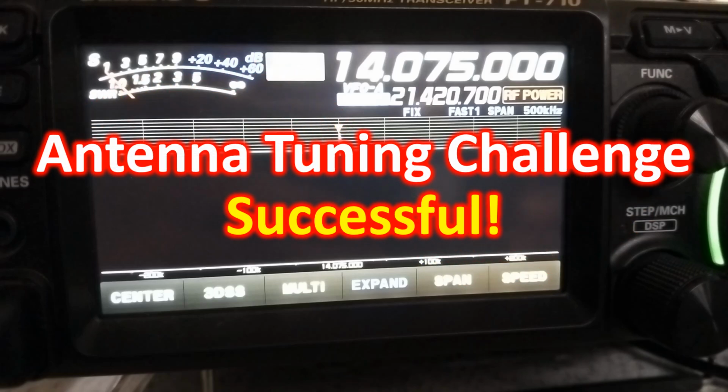It is possible that the antenna elements were not exactly equal on both sides earlier. In that case, asymmetric lengthening on one side could bring down the SWR as well, if it had fortuitously equalized the lengths on both sides.